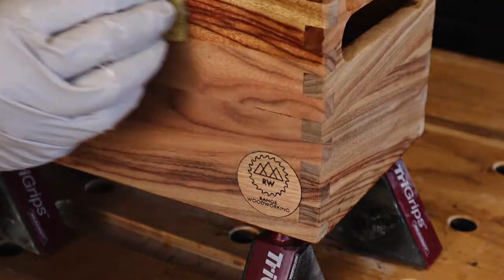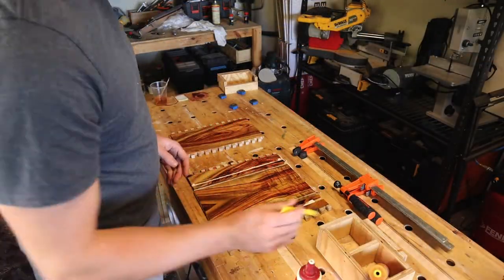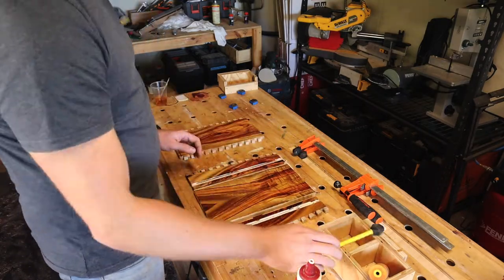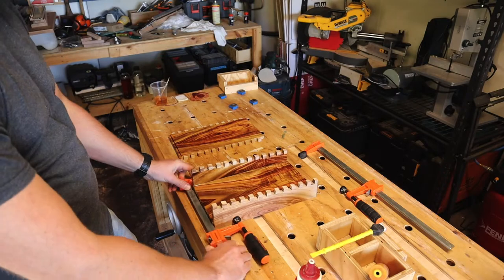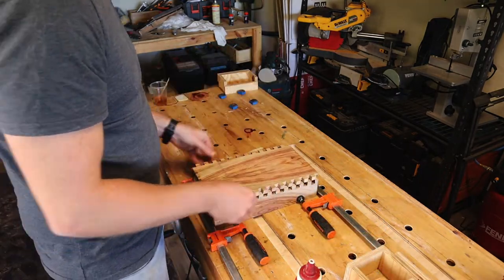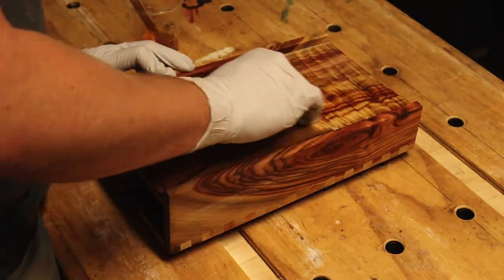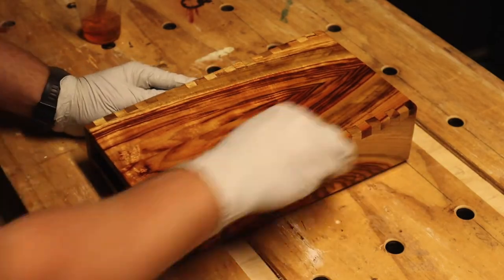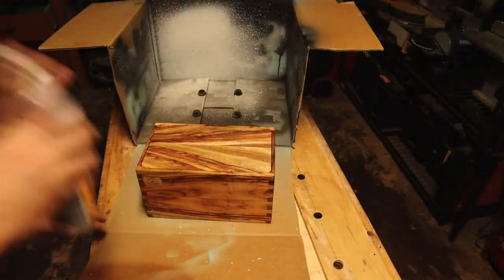This time I'm just putting boiled linseed oil on to soak in whilst gluing up the lid. I tried to use less glue here because tidying up squeeze out inside would be a challenge. Trim the edges flush again and oil the outside of the lid. Time to use this can of spray varnish as a shake weight for a bit before applying 5 or so coats with sanding in between.